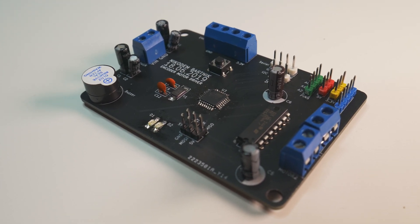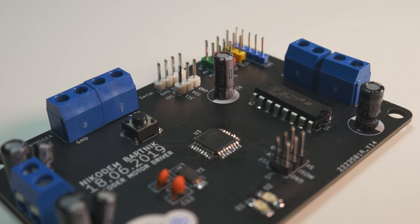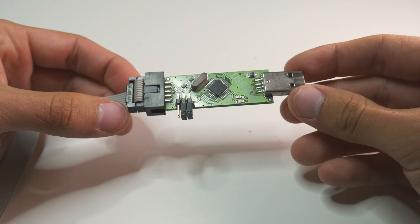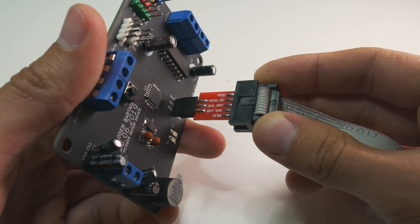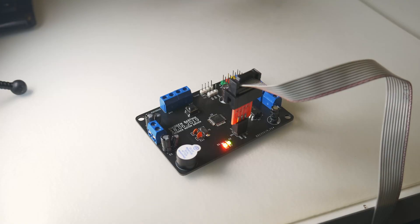The PCB turned out really nice and those colorful headers really add something to it. The matte black color is just perfect — really the best PCB I've ever made. Now let's see if everything works fine. I already uploaded a very simple code to this microcontroller. Because there is no USB port, you can't program this just like any other Arduino — you have to use a USB ISP programmer. The header right here is exactly the same as on Arduino Uno, so you can simply plug it in. Then connect your USB ISP to the computer and, as you can see, everything works fine.